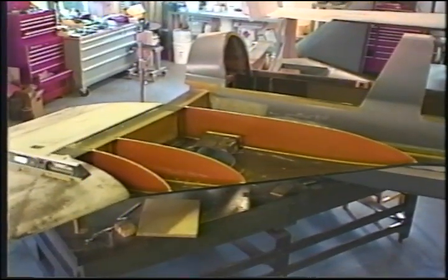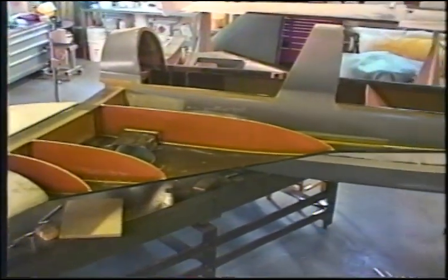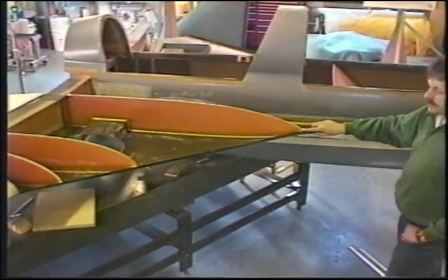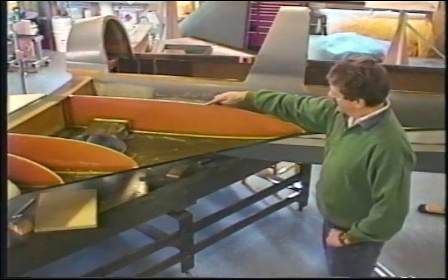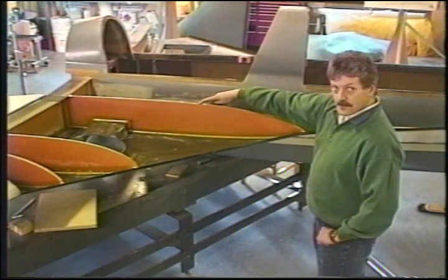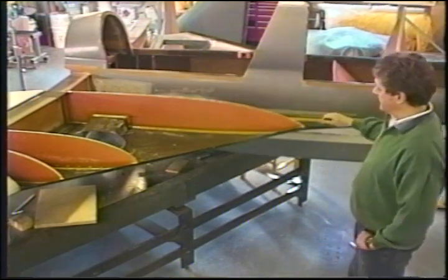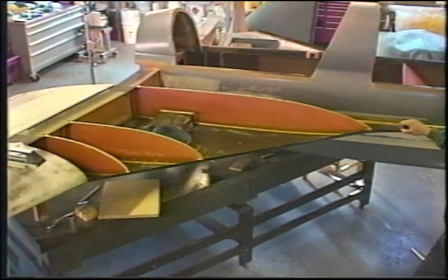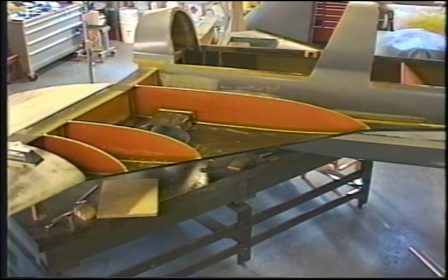Now I'm going to take the wing off and fit the top skin on by tapering the ribs. Berg, can you point to the leading edge forward section top of the rib? Right in there. Go forward, now go aft. This is the area of greatest change, back to about there. And then the rib will no longer need to be beveled, but from where his finger is forward, I'll have to chamfer the outboard edge of the rib off, and I'll do that with all three ribs. And then I'll notch the leading edge overlap area of the upper strake to accommodate the rib, and slip it over the top.